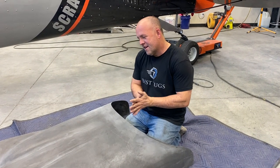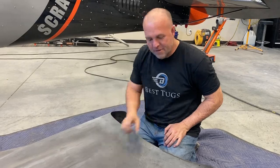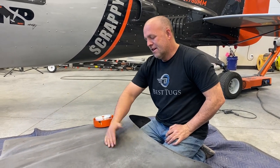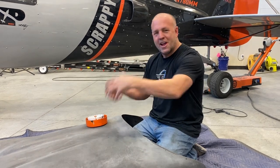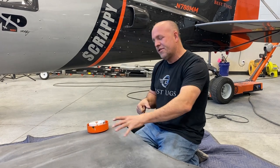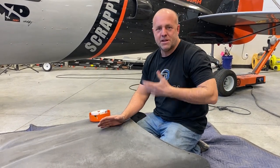All right, guys, top cowling's done other than the oil door. So what I'm gonna do now, I have pre-drilled a hole that's exactly dead center with the oil fill. A lot of times you do a door, you could tip it forward so the wind always keeps it shut. The downside is when you're filling with oil, I'm not so worried about me, but if someone went to be nice and help me put oil in, they tend to want to put their hand up there to brace themselves, and people break their doors off. I want to get the door away from any help that may be helping me or myself just screwing up.